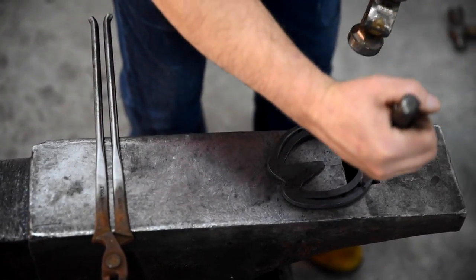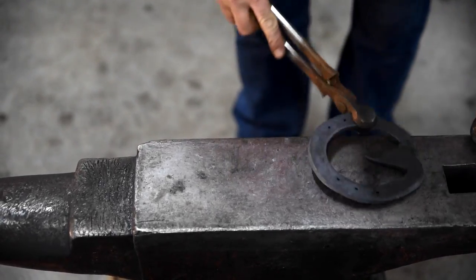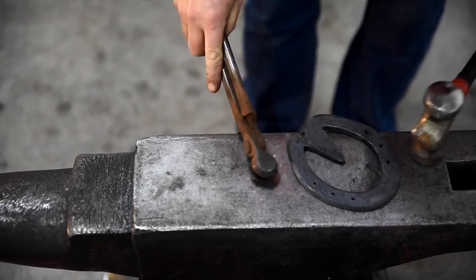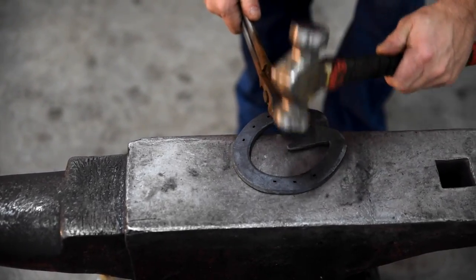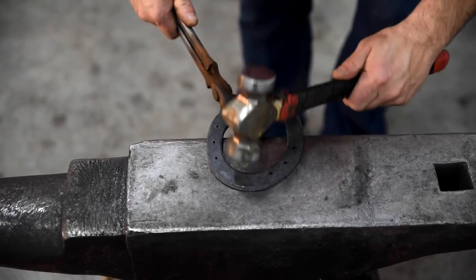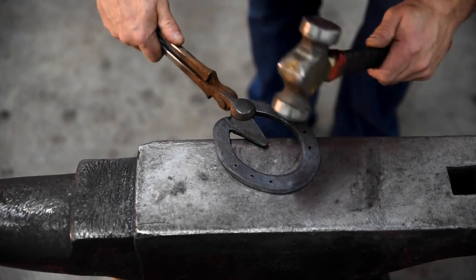It's always important to have a good finish to your holes and a good nail fit. So sharp tools equals, you know, a good sharp nail fit. So I like to keep my tools up together, my stamps correct to the size of nail I'm using relative to the section. And the pritchels, you know, they're a cutting tool. They're not a punch or a drift like what you just use to make the nail hole. They're purely there to fire out the small amount of steel and use as a cutter. And the sharper they are, you know, the more cut through you'll get and the better nail fit.